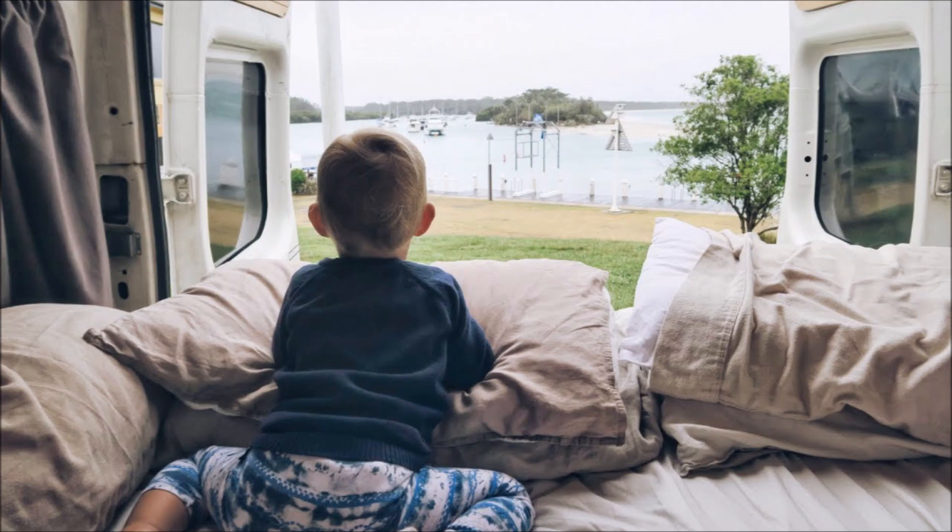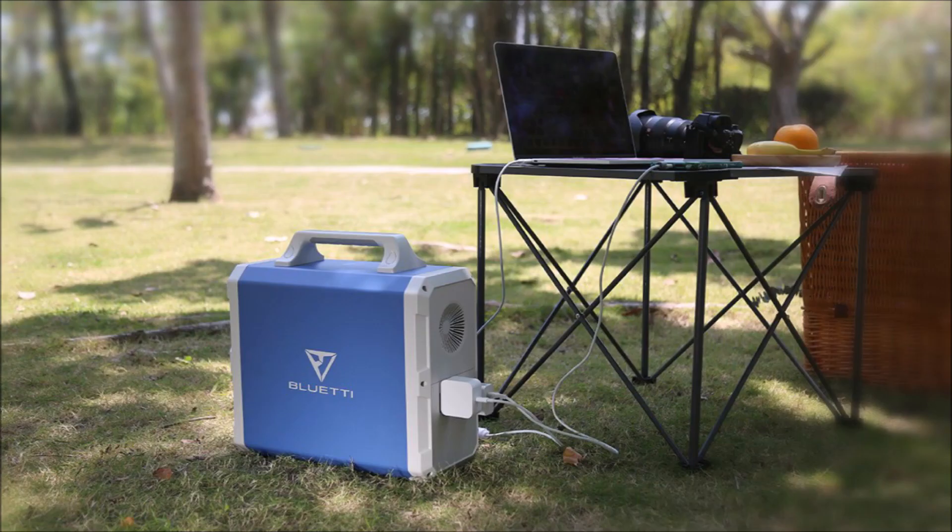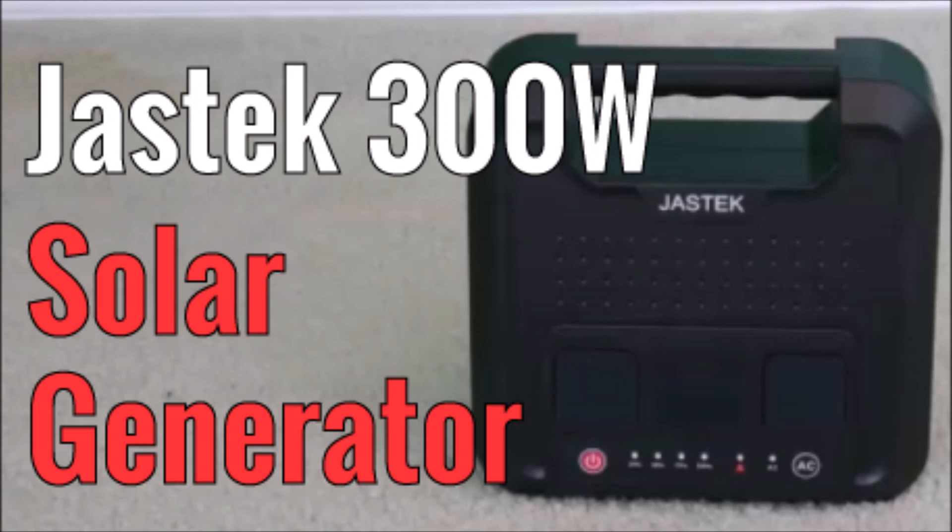And to make matters worse, when it's raining outside, that usually means you'll be inside the RV more, which translates to more power consumption from lights, fans, entertainment, and communication devices. One idea to help mitigate this problem is to pack a lithium power generator in your gear. This won't completely solve the problem, but it will help offset some of the lost production for a short period of time. If it's raining and overcast and your solar battery bank is not charging very well, pull out one of these generators to recharge laptops and cell phones and power your plug-in kitchen appliances to take those loads off of your RV electrical system. Most of these devices will work great for loads of about 300 to 400 watts or less. Then when the sun is shining again or you have an opportunity to plug into grid power, you can recharge it and stow it away for another rainy day.